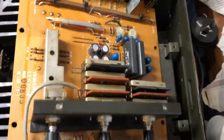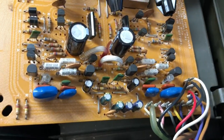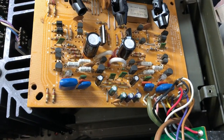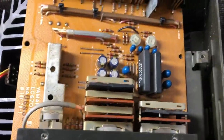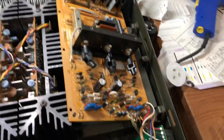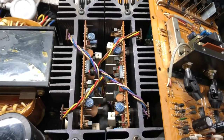I've also replaced the electrolytic capacitors on this board — all except a couple — and I even found some factory-installed goofs where some parts were wrong, so I've sorted that out as well. We've got some really nice new parts in here and this thing is going to sound fantastic. This will have fixed the intermittent phono fault, and the next thing I'll do is put this board back in and take out the amplifier modules to refurbish those as well.